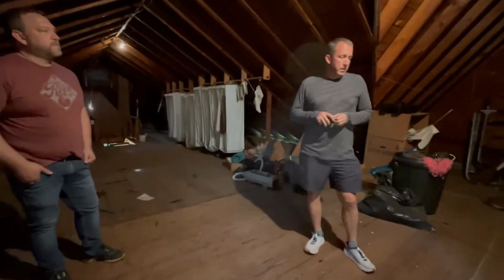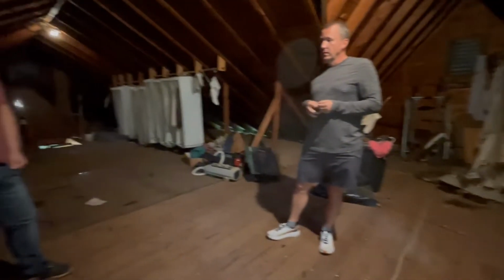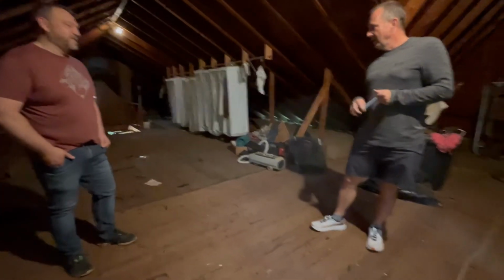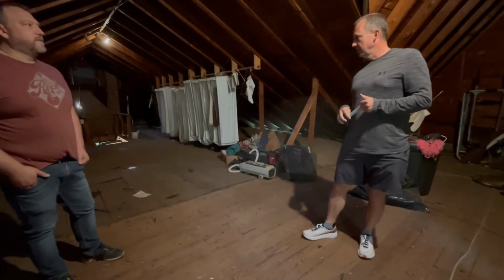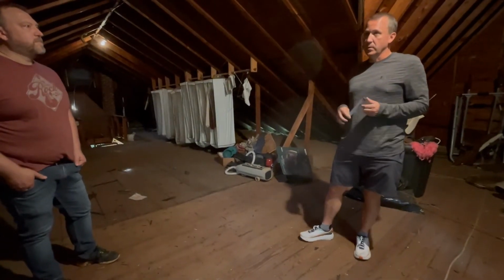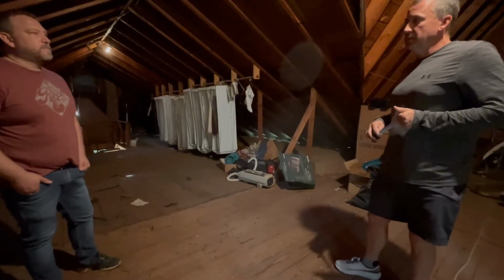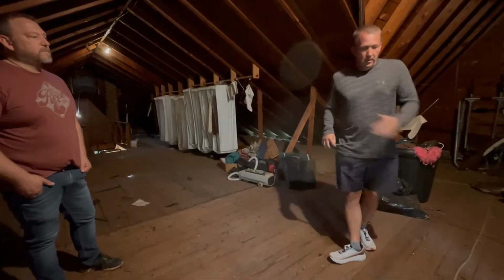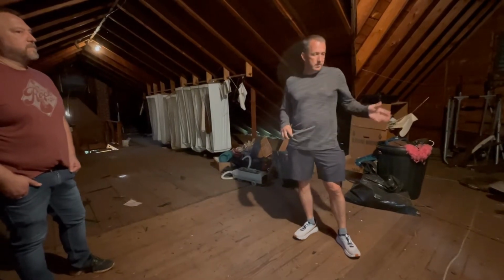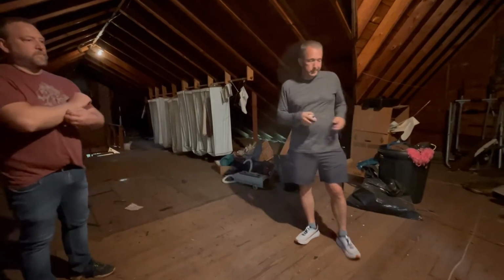Okay. And that's with a minimum dead load, and the dead load would be everything that's sitting in here. Okay. You wouldn't want to pile up a pool table or anything like that. Yeah. Because we're trying to get to the minimum, and that is current building codes. This was built before all the modern building codes were done. It's built well. It's built real well. Yeah. It just doesn't meet some of the deflection requirements because for this span, the tables are based on deflection, and for the use, this would not meet the span requirements or the deflection requirements. Okay. So that's why we split it up.